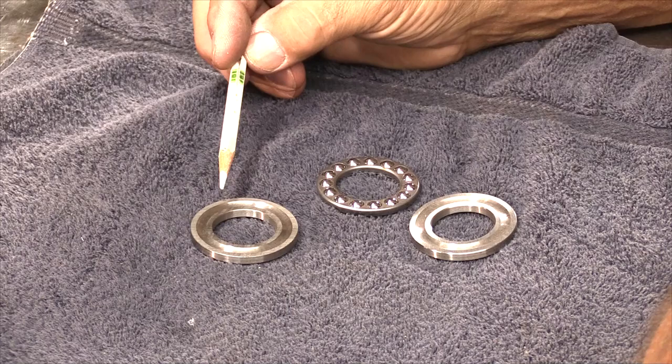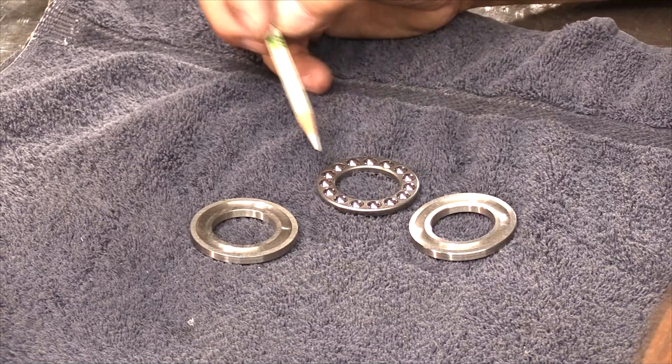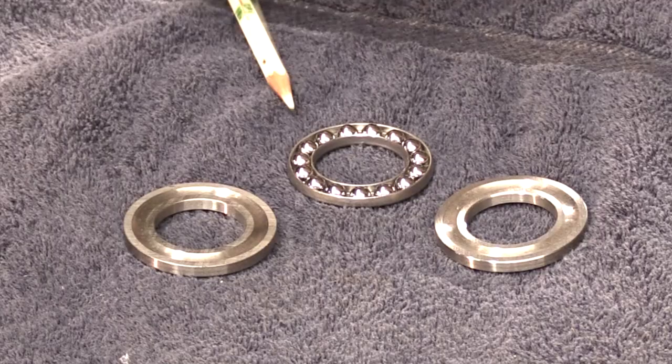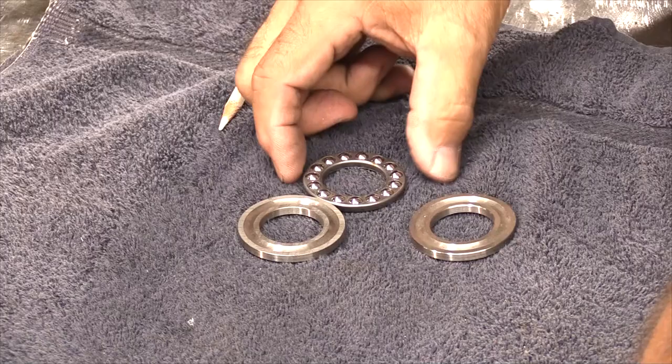You need a bearing or two. Bearings are really simple. There are really only three different pieces to a bearing assembly. You've got an upper and lower race that the bearing actually runs in, you've got the cage that holds the balls of the ball bearings. This is what the other side looks like with the balls just trapped inside. These two edges are just crimped together just a little bit to hold them down inside there, and then the hole in the cage keeps them all aligned, keeps them all separated just the way they're supposed to be.